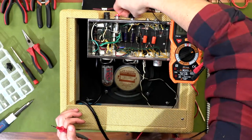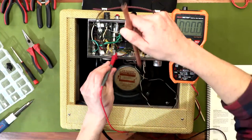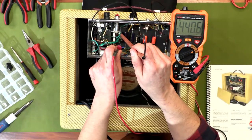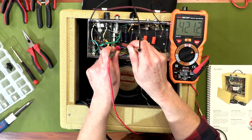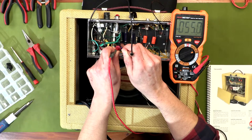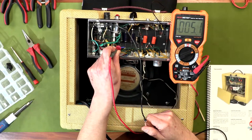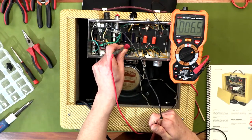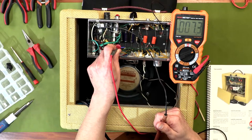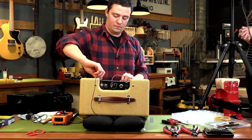I'm using a test lead because I never want to have both hands inside the chassis when there's a possibility that DC voltage is present. For demonstration purposes I'll turn this back on just for a couple seconds. I'm going to that first test point where the red lead meets that blue resistor — that's going to be the highest DC voltage in this amp. You can see on that multimeter: 520 volts. So that's a lot of voltage.